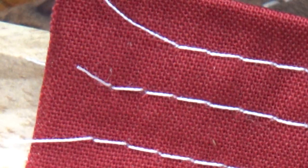So you can look at all three of those stitch rows, and you know what? When we get this close to it, they don't look bad at all. But when I look at that top row, I don't have that upside down, do I? The last one we did was that top row, yeah. When we look at that top row, occasionally you can see just a hint of that knot closer to the top than it should be. And that's again because the bobbin case is not pulling down hard enough. It doesn't have enough muscle against that upper tension. But we've got three decent rows of stitching, and we can even make it better.